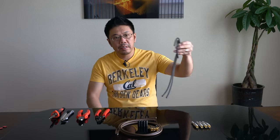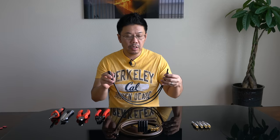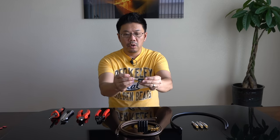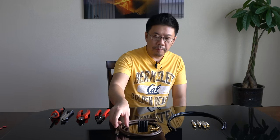What I'm going to build today is using Mogami 2534. I only build the length I need — I don't like long cables. This is the one I've been wanting to try; it's a quad cable. Quad cables are a lot quieter compared to regular coaxial cables, so we'll find out. I'm using the Canare F10 RCA plugs, which are very high quality and very solid, with metal strain relief. I'll be building this using a method some people call Japanese style connection.